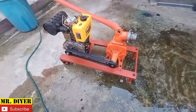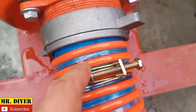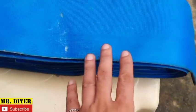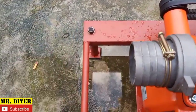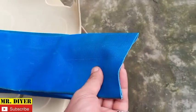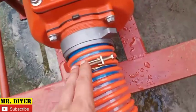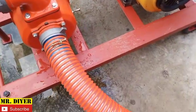I'm quite satisfied with the result. I did some more testing off-screen and added a blue collapsible hose on the outlet side. You can install a collapsible hose on the outlet, but you need a corrugated hose on the inlet side because a collapsible hose would collapse and you won't be able to draw in water from that side. I cut a piece of the blue hose and installed it here, and it allowed for a much better seal. Within 30 to 40 seconds it started drawing the water because there's no more leak.